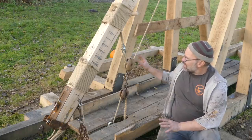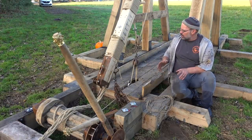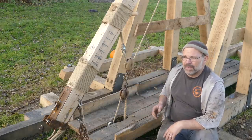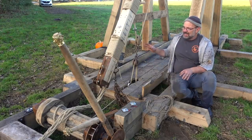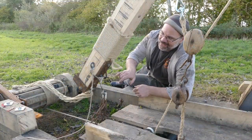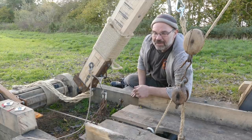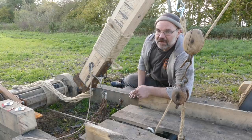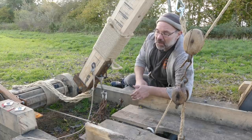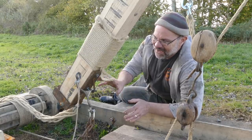I'm also going to look at this rigging — this is actually a medieval way of doing it as seen in illustrations. There's another way that might be easier, but the framework extensions make it not work here, so I'll stick with this system. I've put a load cell on here to measure the weight in the ropes — I know they're well within limits from the data tables, but in my gut it feels wrong, so I'm going to put bigger ropes on. The trigger I'm not going to change — it's a slip hook system. A curved hook rotates around a point when you pull the lever, requiring about five to seven kilos of pull, and slips out cleanly. It looks really alarming and insecure but it's brilliant — it allows a five-kilo pull to release this machine running at 250 kilos.